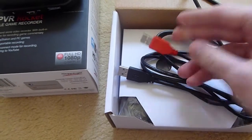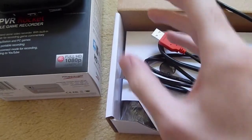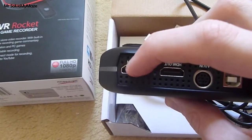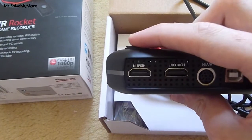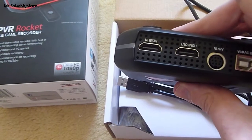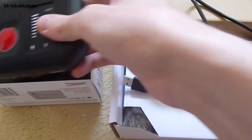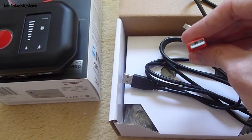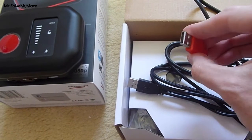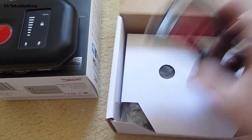What I used to capture the footage I'll show at the end of this video - I've got a laptop, so I just plugged the HDMI cable into this port and then duplicated the desktops, in which case all the data I'm seeing on my screen gets transmitted over to the PVR Rocket. In this case to get power, I used this end of the connector because I'm only supplying power to the Rocket - I'm not supplying any data to it, I'm just sending the signal over the HDMI.